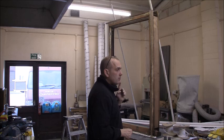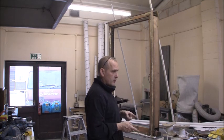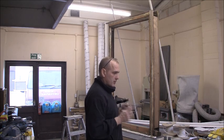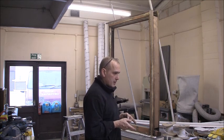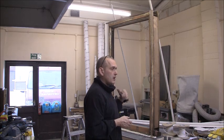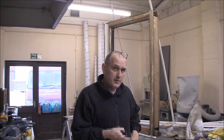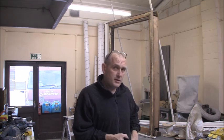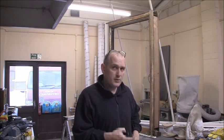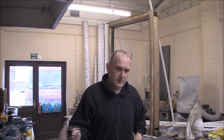So what I'm going to do, I'm going to weigh the sashes, I'm going to weigh the weights, I'm going to see whether they're the same, and if not, I will calculate the lead, then I'll start cording and I'll show you exactly what's involved in that. Okay, I've weighed the sashes, I've weighed the weights, and surprise, surprise, each sash needs 4 pounds of lead adding to the weight in order to balance it out. Now, I'm fortunate, I have a bag of these weights, so that's not an issue.